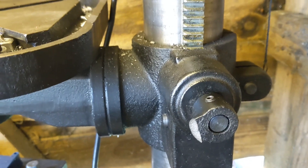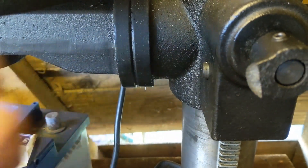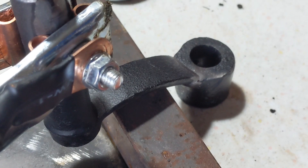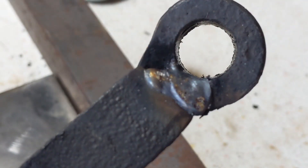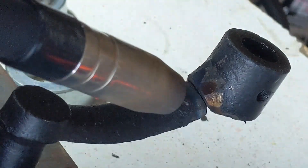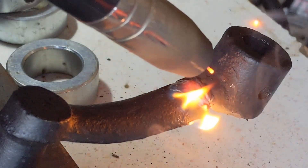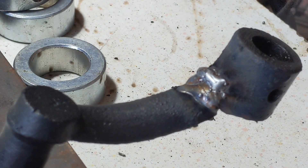One thing I forgot to say is that I managed to drop something very heavy on my pillar drill adjustment handle — the handle that raises the bed up and down. I'm going to try and get that off and see if we can get it fixed with my new welder. Wire speed four, power setting seven. Got a bit shaky at the end but that first bit went in lively — that's not going anywhere. I'm going to get a lick on the other side. And that is fixed, not coming off, no way, never.